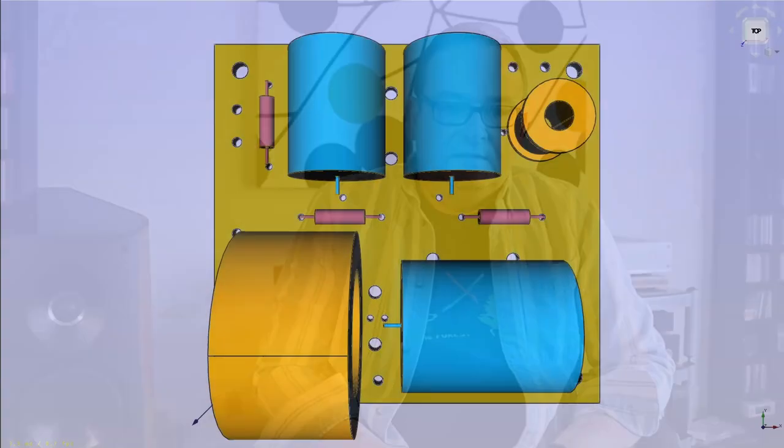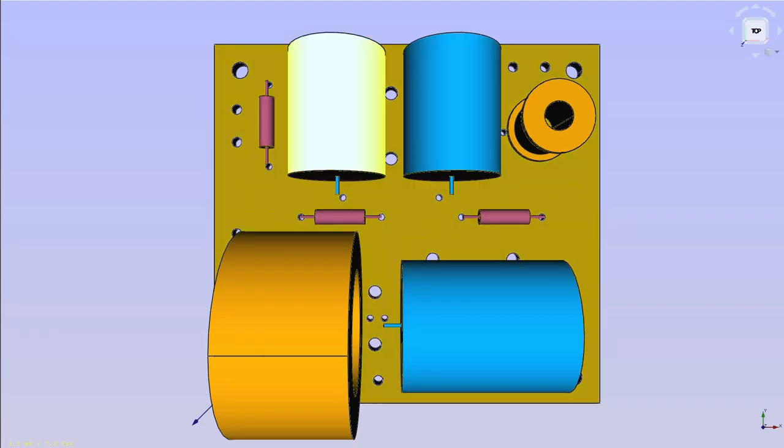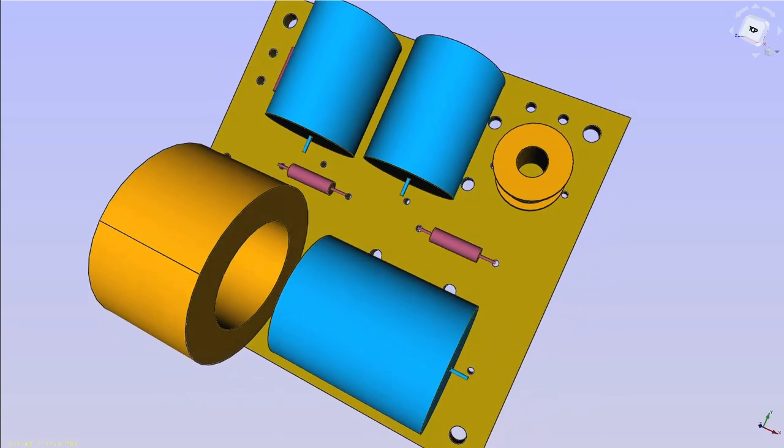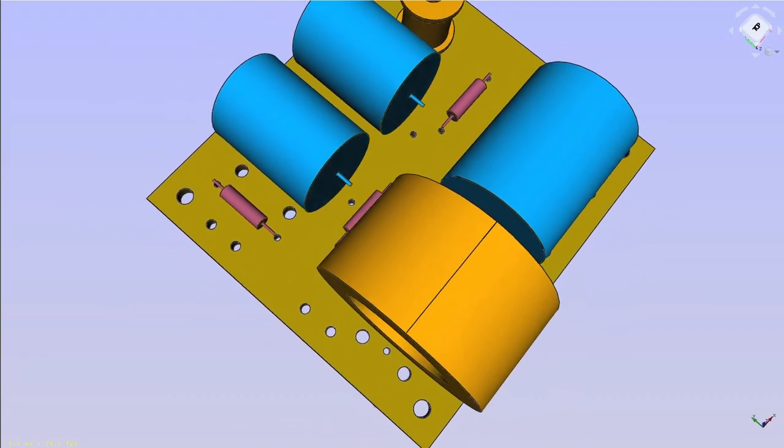You can lay out your new improved parts on a new board. You don't need to have a new circuit board designed and manufactured — it can be done on any suitable backing board. Maybe a prototyping board; a 160x100mm Eurocard size board is about £6. You don't want a full copper clad or strip board for this — even a thin 4mm MDF sheet will do. Here's a 3D model to show the concept. Drill holes in suitable places to secure the new components with tie wraps and/or glue, and wire everything together as per the original PCB scheme with direct point-to-point links. Twist the wires together and solder to secure — this is actually a better, more reliable connection than going via PCB.